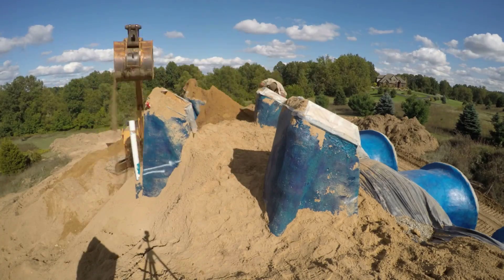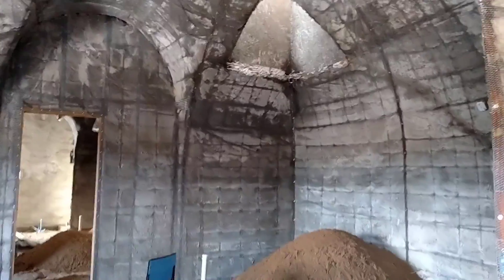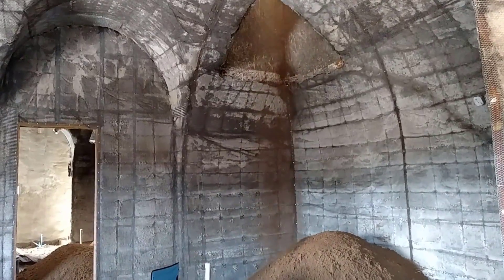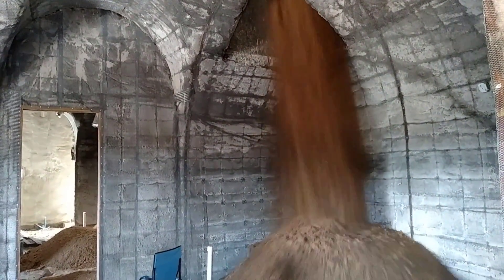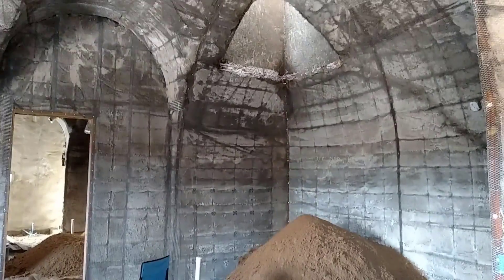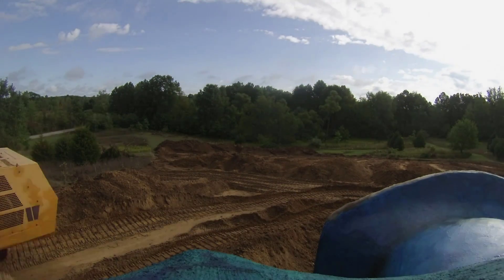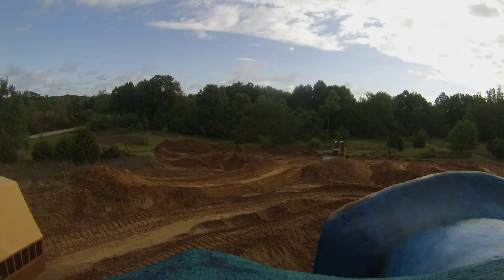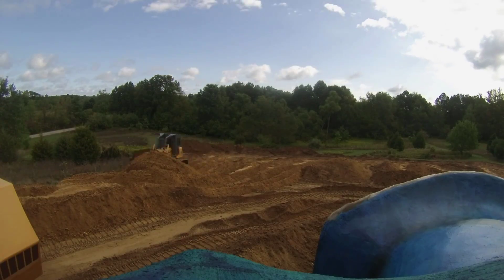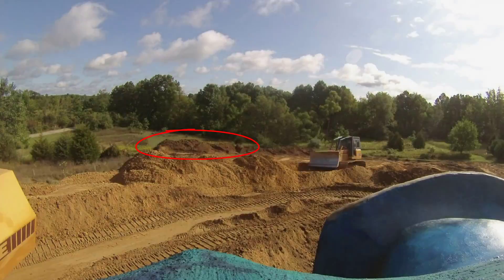When they got started again, I asked Dick to dump some dirt down the bedroom skylights. This will save me a ton of earth moving when it's time to raise that dirt floor level up to within six inches of the final floor height. We also used a lot of this pile of nice sand for making stucco later on. The dirt for the bedrooms came from the area north-east of the house. That lump the dozer is ignoring at the bottom of the hill is the topsoil that he's saving for later.